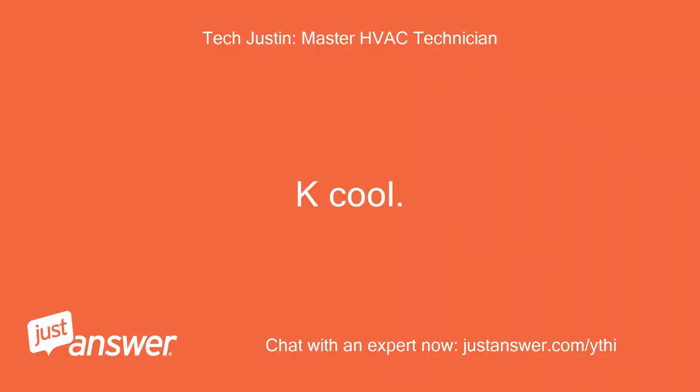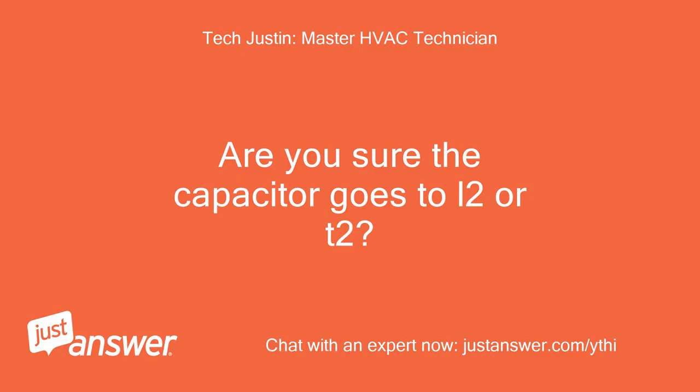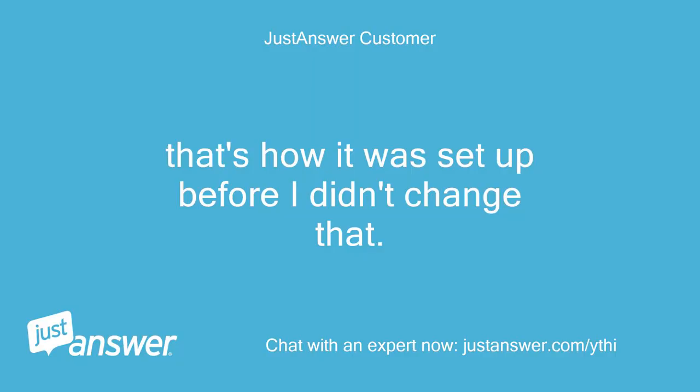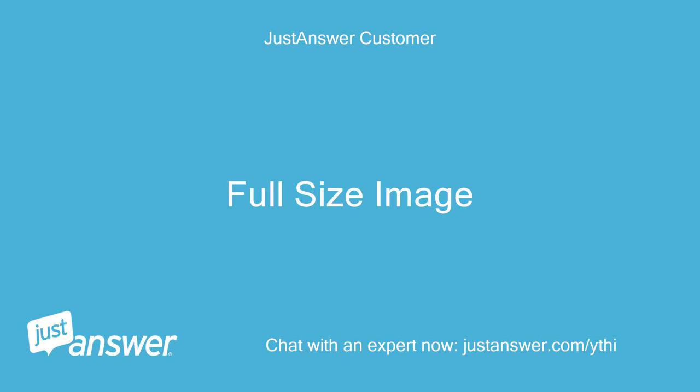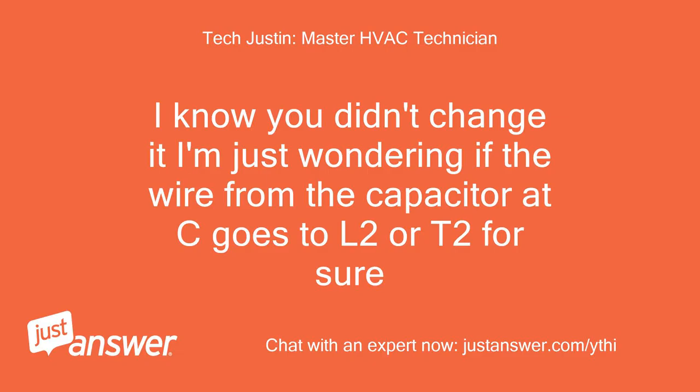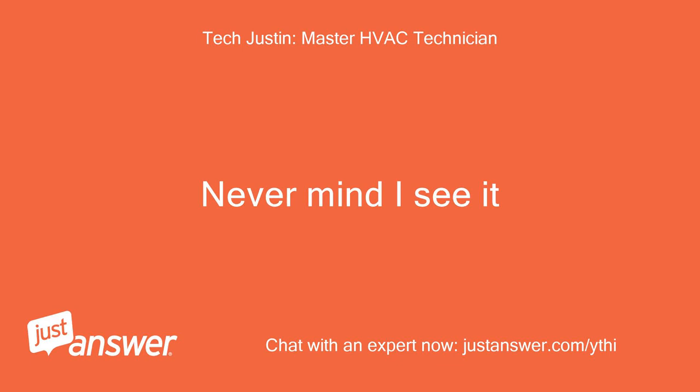Okay, cool. That's the contactor. Are you sure the capacitor goes to L2 or T2? That's how it was set up before, I didn't change that. I'm uploading another now. I know you didn't change it, I'm just wondering if the wire from the capacitor at C goes to L2 or T2 for sure. Oh yeah, I don't know. Never mind, I see it.